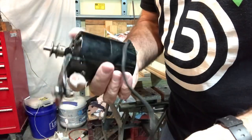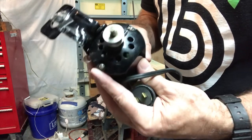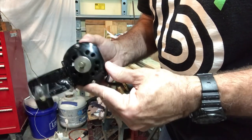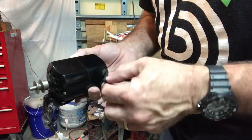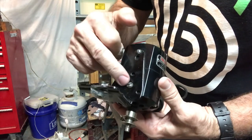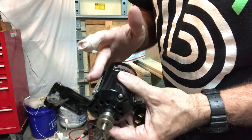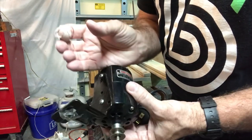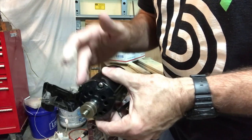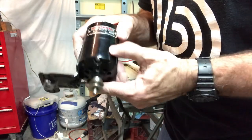So here it is — $10. What I'm going to do is plug it into my router speed control that I use on the other sewing machine motor on the pillar tool, because that gives me variable speed. It works fine. So my plan is to unscrew this mounting bracket here and screw in a piece of channel aluminum in its place, and hopefully mount it straight on top of the spindle.